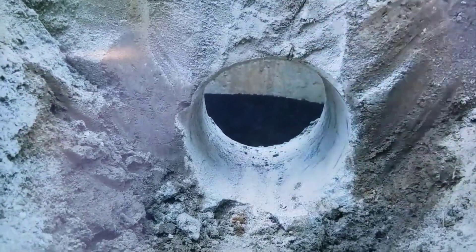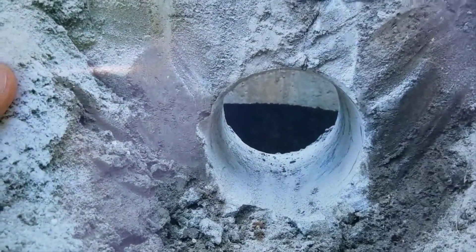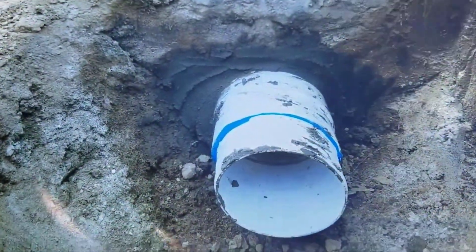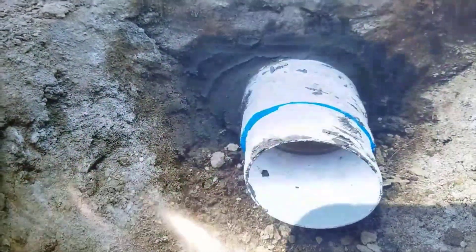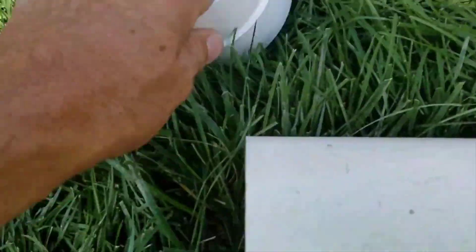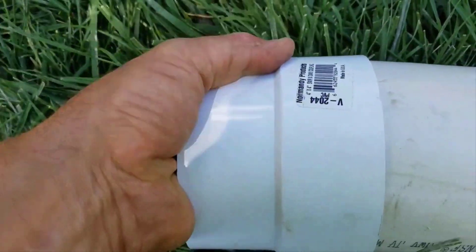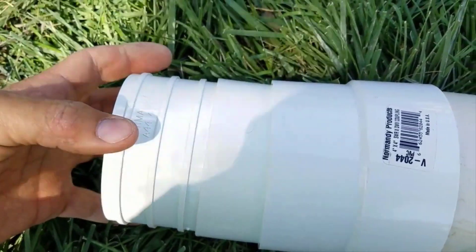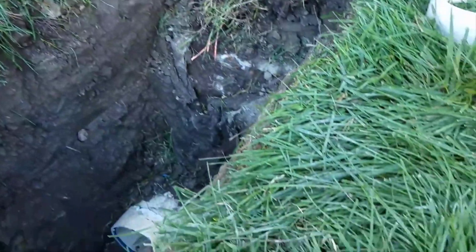Here's a picture of a really nice core drilling of the sidewall of a storm drain catch basin. You then have to sleeve it — we use schedule 40 and hydraulic cement to hold that schedule 40 sleeve in place. We then put this coupling over the schedule 40, glue this adapter inside that, and then the French drain pipe — the perforated corrugated four-inch — just snaps onto that.